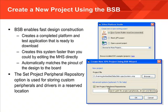The UCF file also contains your design's timing constraints. These are used to communicate to the implementation tools how fast you want the parts of your design to operate, and most specifically, it's going to make a global constraint for each of the clock domains. So if your processor system has two different clock domains, one for buses and peripherals and one for the processor, then the tools are going to have a timing constraint associated with each when you use the BSB. So this is a good thing. It's going to save a lot of effort and a lot of understanding.